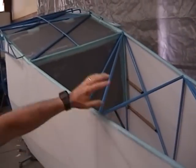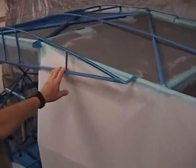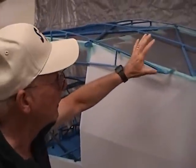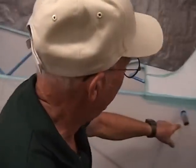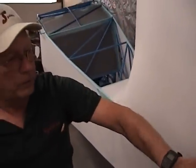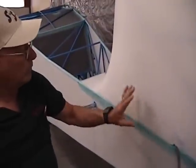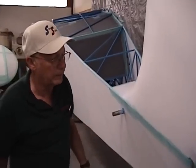What we'll do now — I've shown how to do these side areas here. I'm going to go ahead and get this side covered, and then the next step will be to go ahead and get the top fabric put on it. The only thing left to do then is lay out wherever we're going to put our reinforcing tapes. We're also going to have to put a nice finished ring around here, and there's also a fairly large grommet that glues into this area here so we can get in to attach the fittings on the elevator horns. So once it's all on, we'll go ahead and show where all these pieces go.